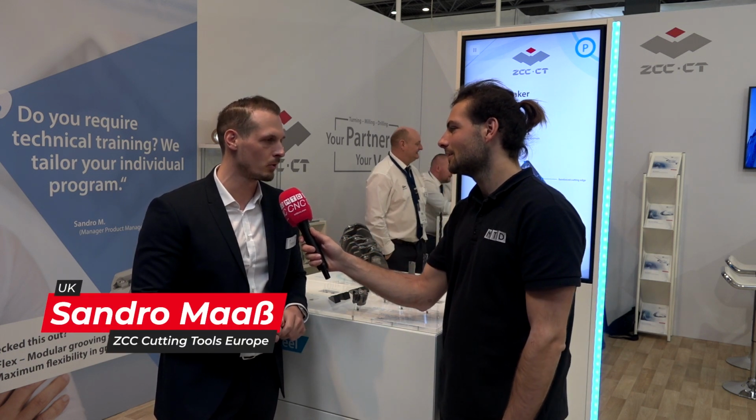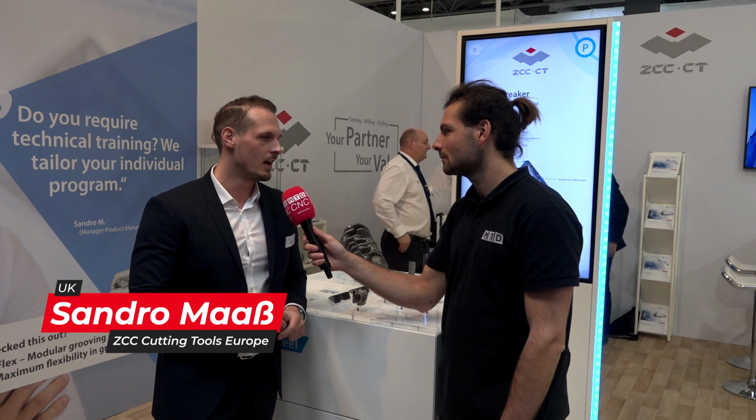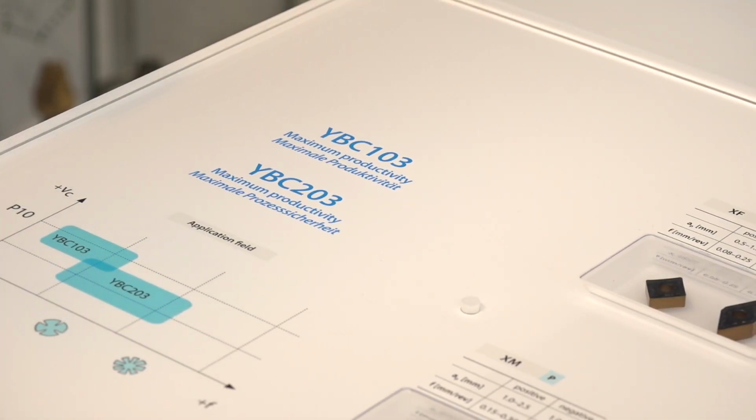Yeah, we want to talk about the new grades YBC 103 and 203. Most common application in the turning grade, especially for the P materials. And I will a little bit explain how to work with this kind of grade. YBC 103 is more for the productivity way, and YBC 203 is more for the reliability one.